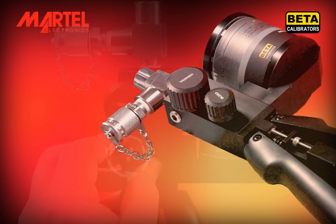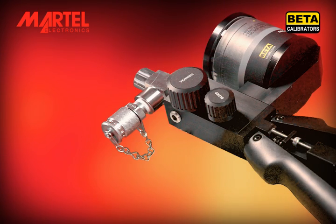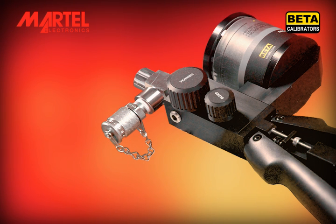Now lay the pump over to a horizontal position. This will allow the internals of the pump to fill with the fluid media. Wait a few moments. You may see fluid starting to drip from the ports. This is expected, as it indicates fluid is traveling through the pump.